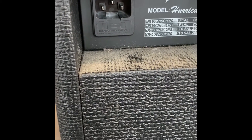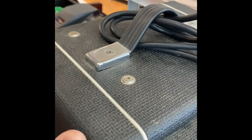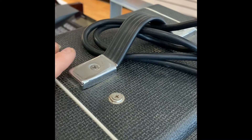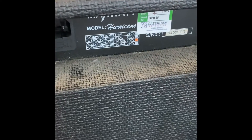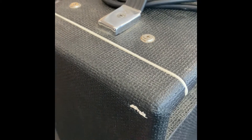I don't like doing it, but again, that's the only way of getting an earth. Now, luckily on this one, this is all a wooden case, but actually all of these screws — I could get an earth reading off of that, so they must go through into the metal casing underneath. Just something to watch out for when you do these, because they can be a bit tricky.